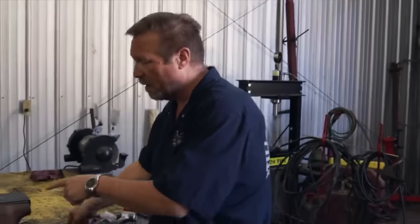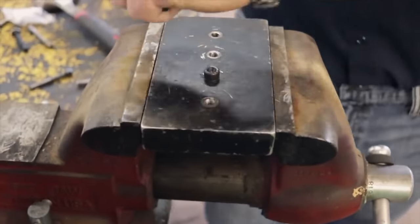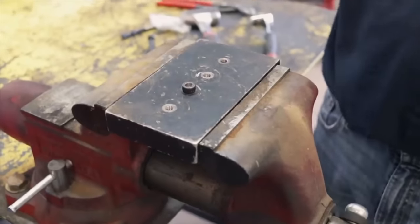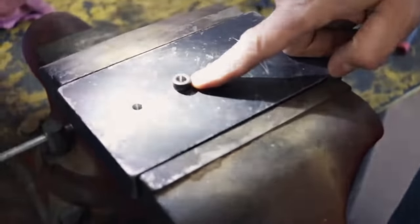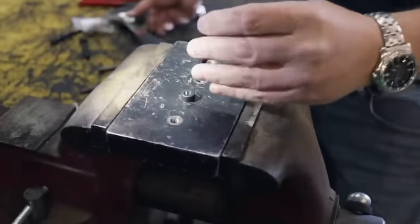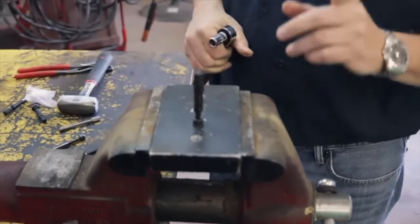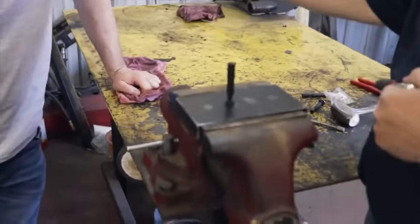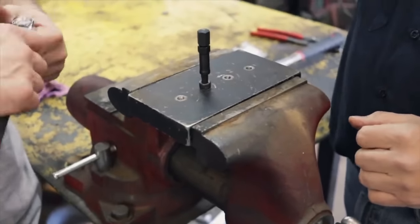What I've got here is a demo block using a cap screw — let's say for argument's sake I've snapped the head off a bolt and drilled a hole. It's not just about cap screws; it can be used on broken studs, anything like that. We've drilled our hole and now we're going to pound our extractor in. An extractor only has one job and that's to bite — the better the bite, the better your chances of getting it out. I've got Jay to help demo this with a ratchet in the tightening position so you can see how well these bite.